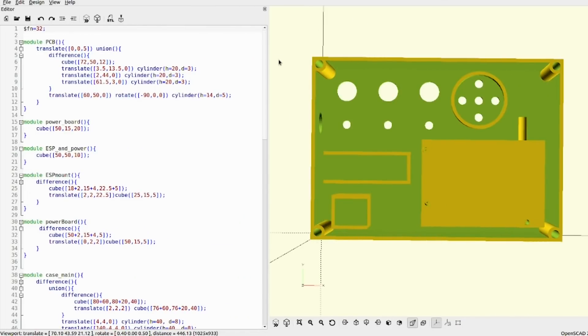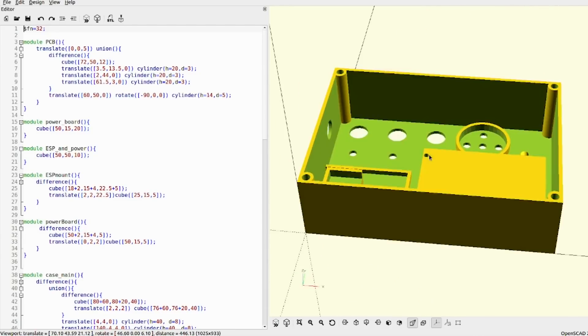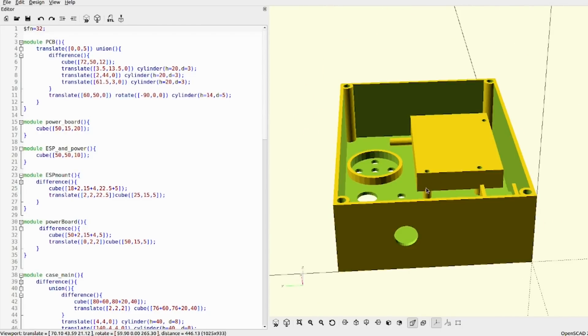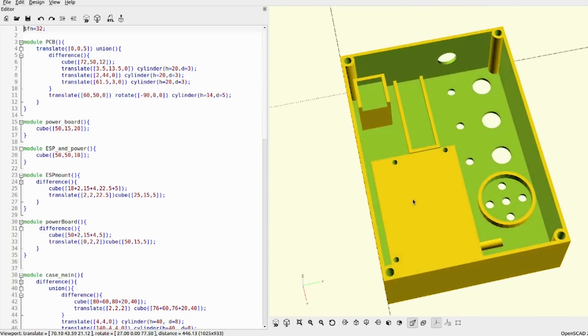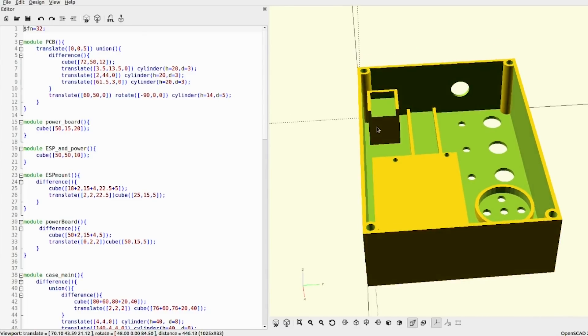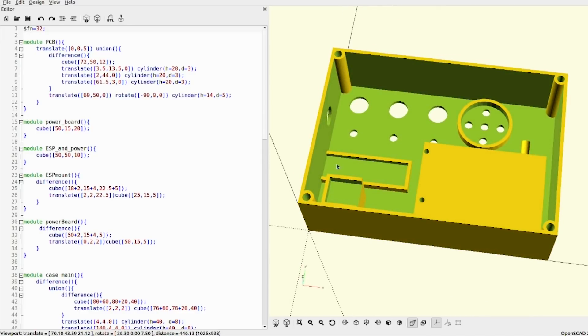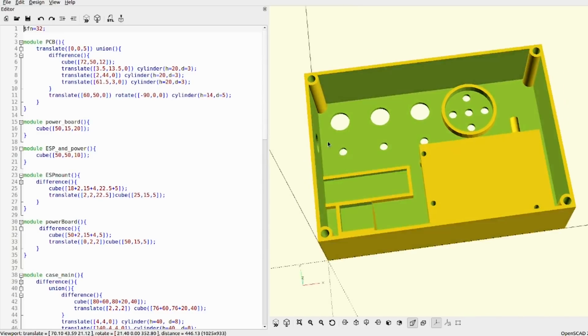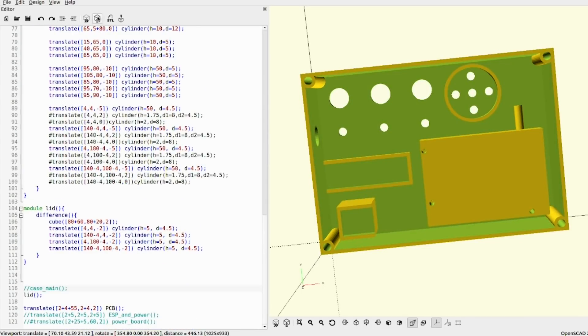These are the 3D printing designs I've got, all designed in OpenSCAD. I've mocked up a rough size indication of the PCB I've taken out of the old doorbell system with standoffs to screw it into. I've made a holder for the speaker that was on the original doorbell, and a space that will hold the ESP8266 - this is quite tall because it's got pin header coming down from the back. I've got a little recessed area to hold the 3.3 volt voltage converter, holes for 3 push button switches, 3 LEDs to show which I've activated, and a hole in the side for the DC barrel socket.